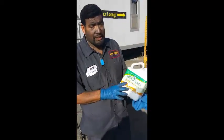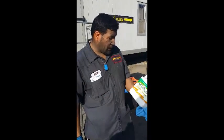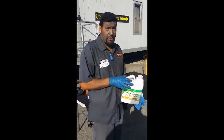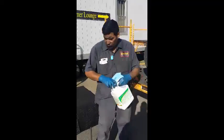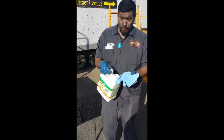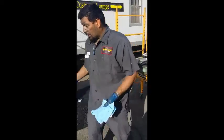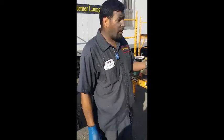The best thing to clean it with, we found, is this mineral spirits. You can pick it up at Home Depot. This is a green product, so it's really good. It's not so harsh. But anyway, you can spray it on, but for this tutorial, I'm just gonna dab it on. And make sure you're using microfiber towels. Make sure you're using a clean one to take it off, because you don't wanna just be moving dirt and compound around. You wanna actually pick it up.